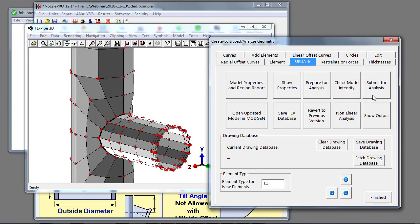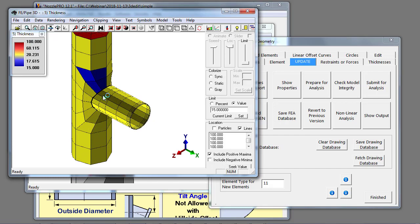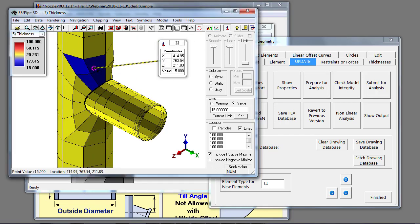The input screen lists the node numbers in the geometry and the element number that's selected. I can change the element thickness — instead pick 15 millimeters — and then save the geometry, go to update and prepare for analysis. I can go to the show properties input button and it brings up a thickness profile plot where I can see, using the thermometer tool, that this single element uses 15 millimeters. You'd never want to model this coarse element mesh with a thickness gradient in this manner, but with a fine mesh where you can pick groups of elements to specify a corrosion path, it's a very quick way of specifying different thickness profiles.